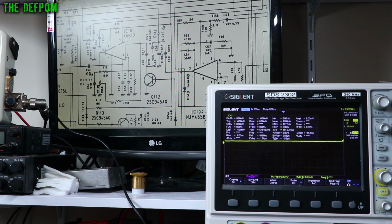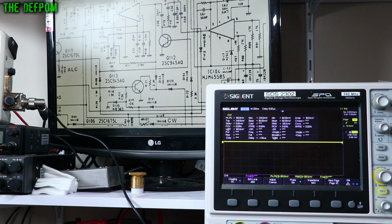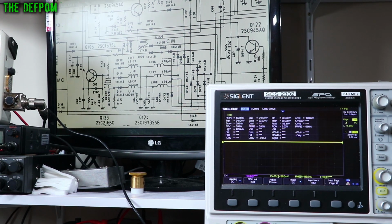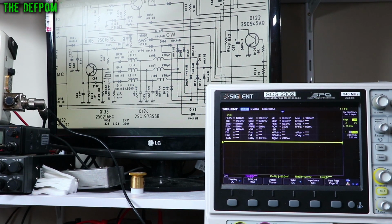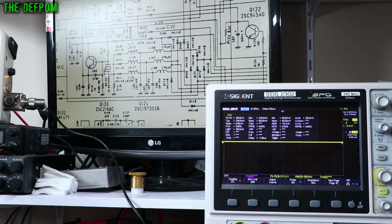Let's go. There's upper sideband. There's lower sideband. There's the IF coming in before it's filtered by the balanced modulator. AM's got nothing there. FM's got nothing there. When you transmit, there's the FM one, which is fine. AM is missing. So that IF comes in through this capacitor C53, comes from down here, which is the IF oscillator, right? And this has got various complicated switching through diodes and stuff over here, and there's quite a lot to it.